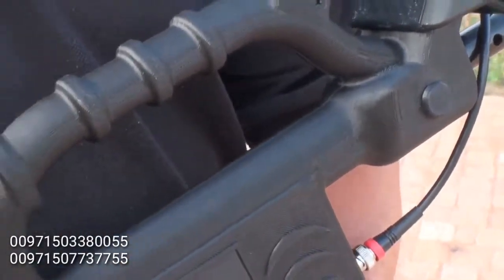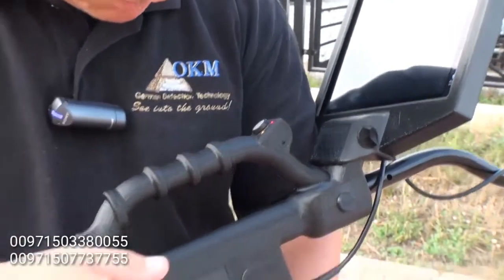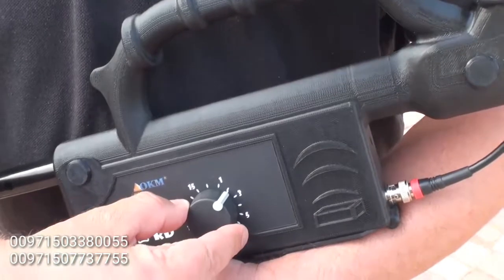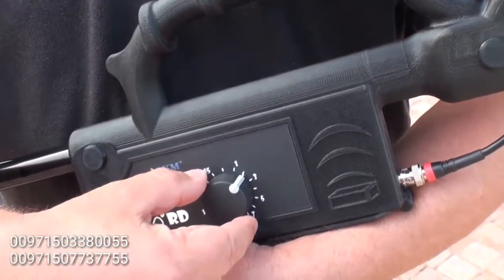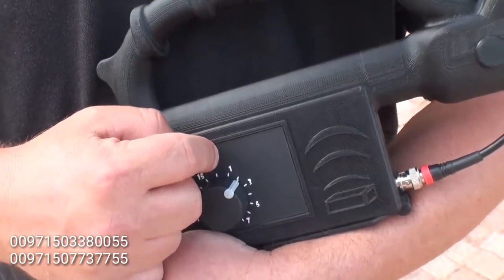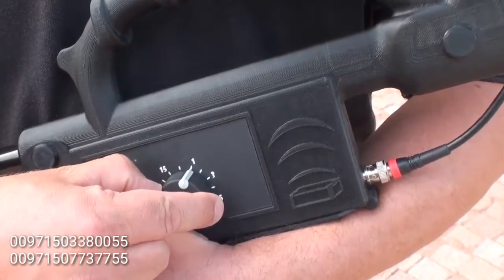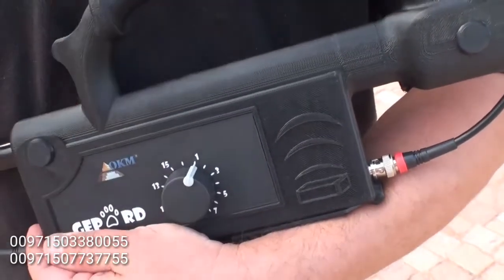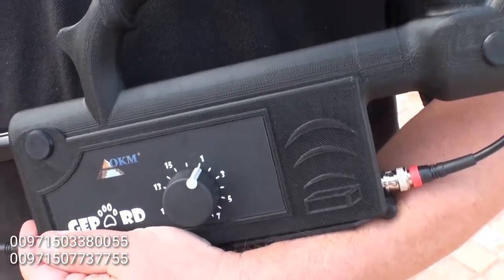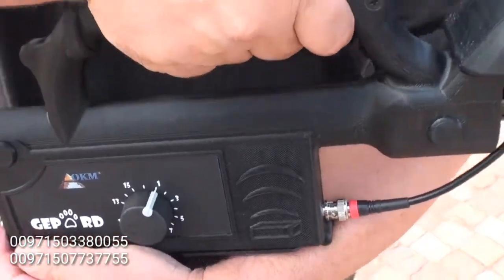As I check the depth: my one object at 3.8 meters was my middle mark. By changing my knob to position number 1 or position number 2, I will be able to better check my depth for a more accurate result in this particular soil. So if I was at 3, now going down to 1, I should just see the top of this anomaly, which would give a much more accurate depth reading because the lines will be closer together.